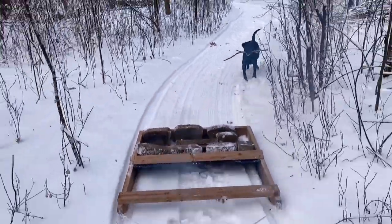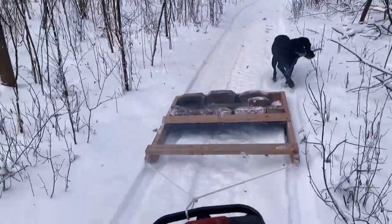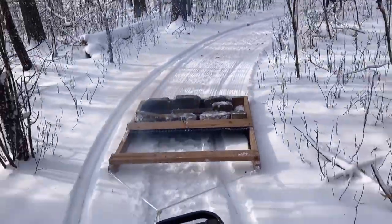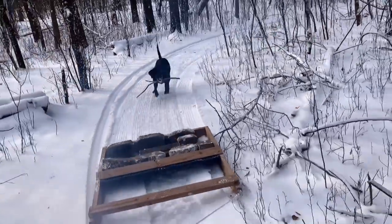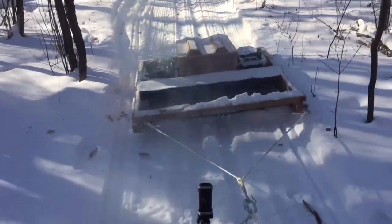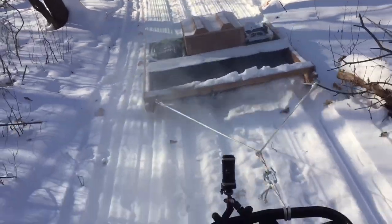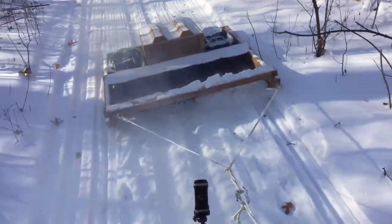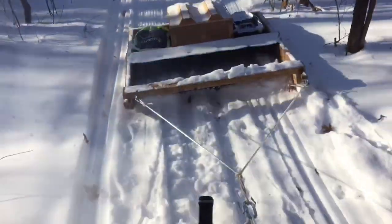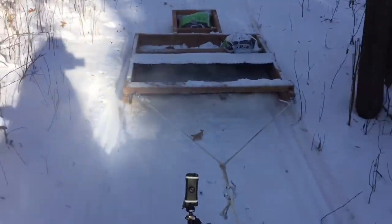Here's the first time I used the groomer. As you can see, I didn't have the track setter on it yet. I had it loaded down with landscaping bricks, and there wasn't a ton of snow, but you can see it didn't even get rid of the marks from the tracks. Here it is going over an old tracked path from before. If you look at the front where those fingers are, you can see it's doing a pretty good job of scraping the old track out and getting a fresh layer. It definitely scrapes the old snowmobile track, so it worked pretty well.